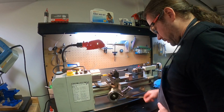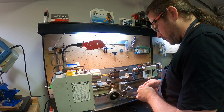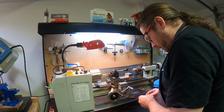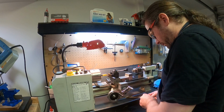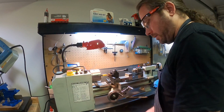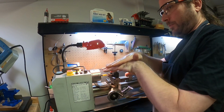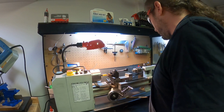So the trick that I do with this is I have some copper tape. You can buy a roll of copper tape at the hardware store, and I use that to make this a little bit thicker so it actually makes contact. Otherwise, it doesn't really do a good job of making contact. There we go. Yeah, the battery was just dead. Oh, and also the contacts are messed up. So both. But everybody just learned a really good trick there. If you've got one of those disc batteries with that pressure type contact and it doesn't make good contact anymore, use a little piece of copper tape on it and it works great.